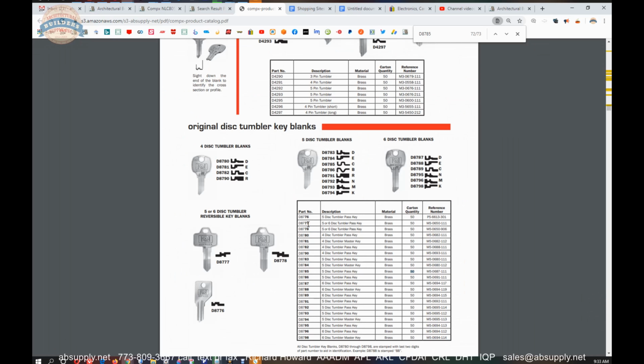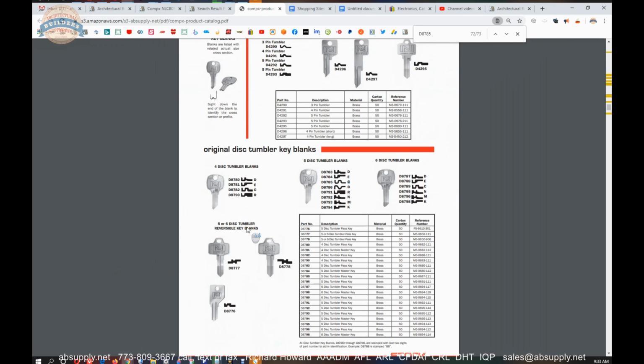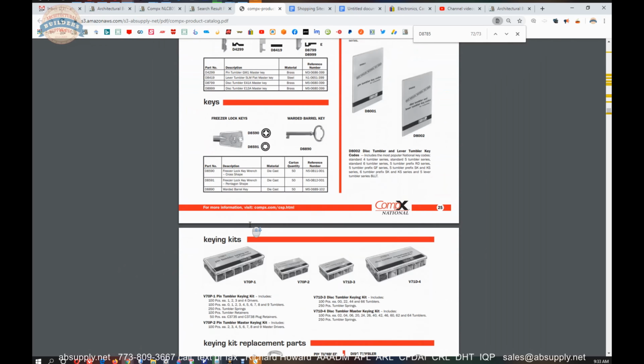So we don't really get into defining what keyway the manufacturer is working with, but the key is stamped C346, so that's telling you it's a C keyway in a 346 code. Well, pardon me, indirect code is what it would be. 346A is a reference to how that key has been cut, but that's an indirect code. We don't know what the bittings are of the key itself based on that. We'd need a reference document to review.